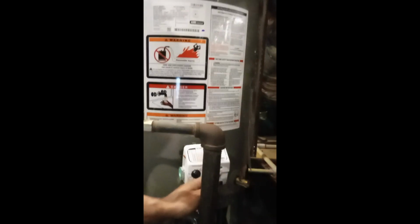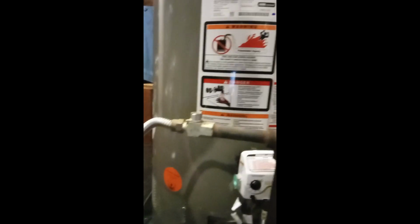Right now it's actually in a good spot in a sense. I got my gas right here, and here's the actual gas from the house. Then I'll just end up putting that in there. And I have my pressure relief valve up here where it'll come down, and this is why I had to angle it the way I angled it. The PVC hose or whatever tubing goes on there, I needed it to come down on this side of the tank, into this area, so that when I relieve any pressure, it still goes to the pan. If I had it the way it was before, all the gas would be in this corner, but my drain would be hanging out the edge of the pan, and water would get all on the floor. That defeats the purpose of relieving the pressure.